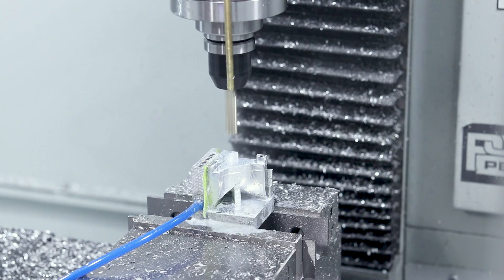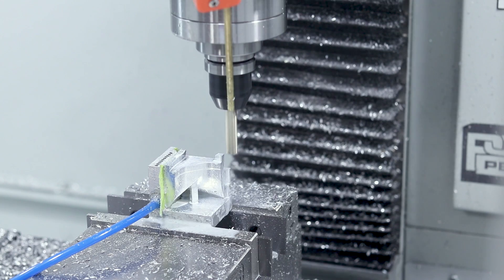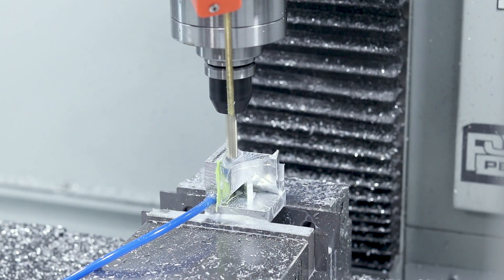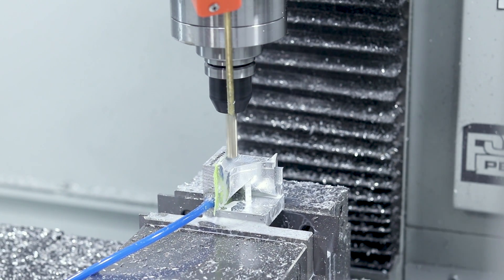Now that this is all said and done, we probably don't need that air vent to help cool the fixture. As a side note, we've also found some new tape that works even better and is able to withstand slightly higher temperatures. We found that common household masking or painters tape — the adhesive fails around 90 degrees Fahrenheit, or 32 degrees Celsius.